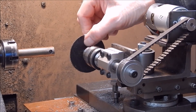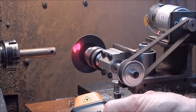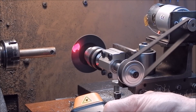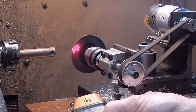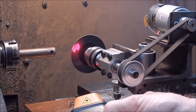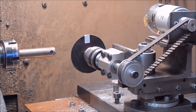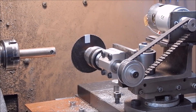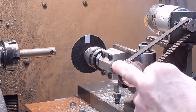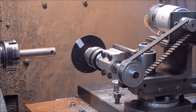I'm just trying to do a speed test — I've got a bit of reflective tape on there. 3,077 RPM. That's about what I expected — that's pretty well ideal for drilling. So that's a good speed at 19 volts. Wouldn't want to go any faster — that's just perfect.